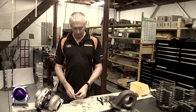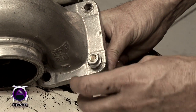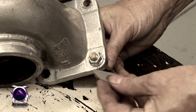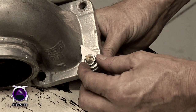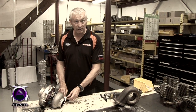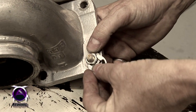The way they work is you put the stud in place, you tighten down the nut in the usual fashion until the item is torqued in place. Then you fit the locking tab over the top of the nut, putting it on the end so it can't rotate anti-clockwise and come loose. It physically holds the nut from rotating loose, and then the whole load is held in place simply and easily with a C-clip.